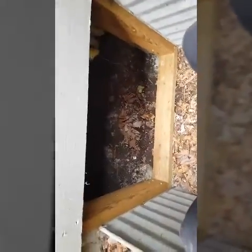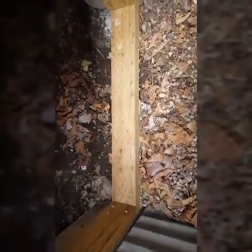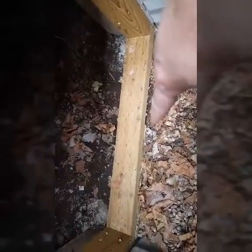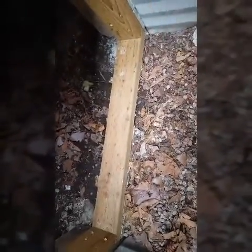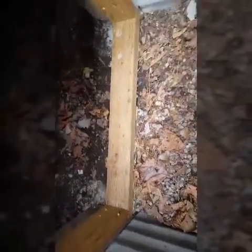Okay, so the frame is in. Alright, and I have another piece of pressure treated wood along the top of the mud sill behind this board. I had to dig in a screen underneath the brick to prevent burrowing, and it's going to take probably about a day or two for those bricks to kind of seal together with all the liquid nail and some patch concrete that I used. But this thing ain't going nowhere.